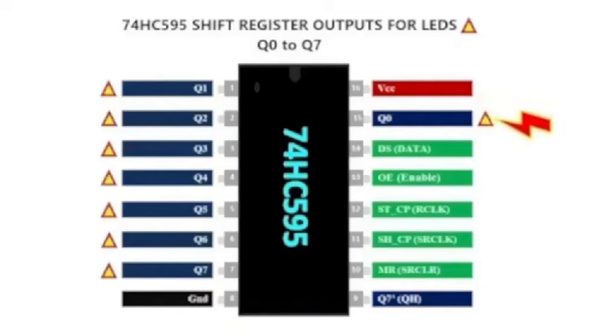On the Raspberry Pi I have a five-volt side and a three-volt side. The LED outputs — Q0 through Q7, or QA through QH — that's where all the fun goes. You can use them as extra outputs as well. Keep all the bits on with nothing in the physical circuit and it works perfectly. But for logic and binary counting, definitely use all the shift registers together — they're not happy with only part of a register.